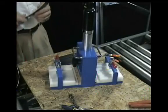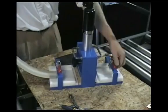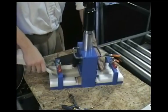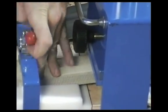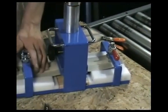A special cutter is used to prepare the ends of the belt for welding. During this process, you may need to clamp the belt ends to the work surface to keep them from falling away. With the V-Guide facing up, insert the IntelliQ belt into the cutter on the side with the black knob. Route the belt under the pressure plate and clamps until the edge of the belt aligns with the end of the cutter base.